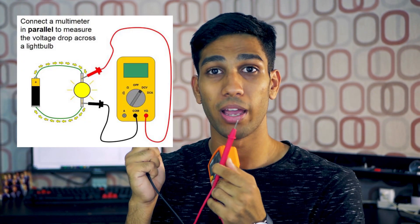Let's talk about how to use the multimeter probes to measure what you're going to measure. If you're measuring anything like resistance or voltages, you want to connect these probes in parallel to what you're measuring. If you're measuring continuity or current, you'll be wanting to connect the probes in series to what you're measuring.